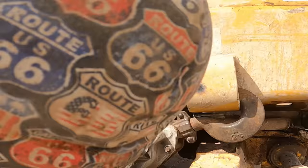Anyway, so as I mentioned, I'm gonna grind off the bottom of the welds. I'm gonna grind off this weld here. Grind that one down flush as well, just so I can put a piece of plate across here, like I was talking, under here, in that area, just to help it. More so on this side that I didn't like the way that was welding.